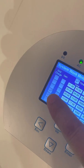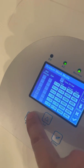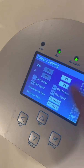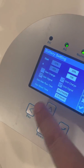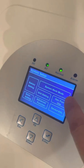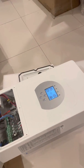For grid charge, you set it if you want to charge from the grid — either 10, 20, or 30 amperes, it's up to you. That setting is separate under battery settings. Here, grid charge is set to 10 amperes and will activate when it reaches 30% at a specific time you configure under system work. That's all — thank you for watching. Please like and subscribe to my channel!